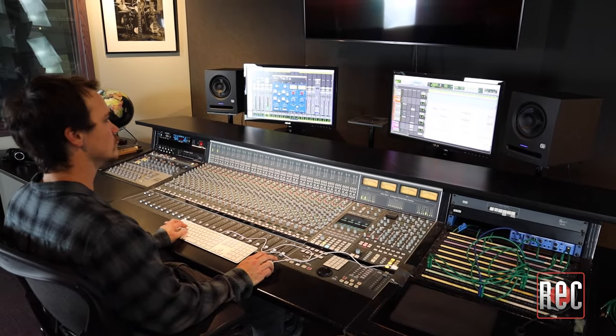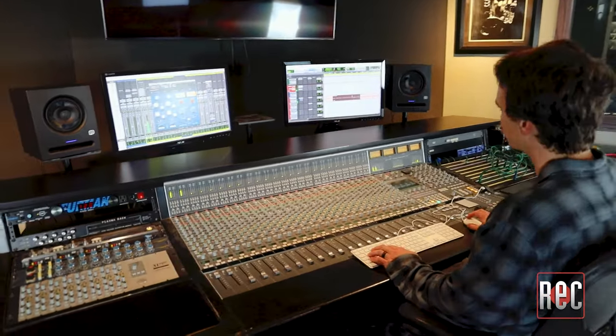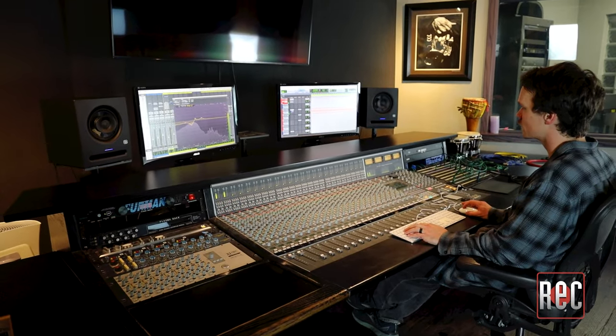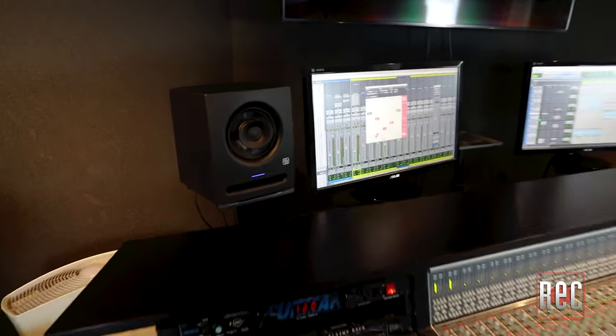I tested the Ares Pro 6 on a range of post-production, music mixing, and critical listening. For the purposes of this review, I had all tone controls flat and the input gain at unity. In each instance, I was met by a balanced tone and excellent imaging. Perhaps most impressive is the even dispersion, both horizontal and vertical. The response remained smooth and intact as I moved throughout the room and even between sitting and standing. These are efficient and can get loud in a hurry. The sweet spot is in the neighborhood of 70 to 80 dB SPL with very focused results even at 85 dB. Once you push up to 90, the woofer felt a little strained and the lower mids were slightly less focused. That said, you wouldn't want to mix at those levels for prolonged periods anyway, so sticking to friendlier listening levels plays in your favor for your ears and tighter, more accurate reproduction.